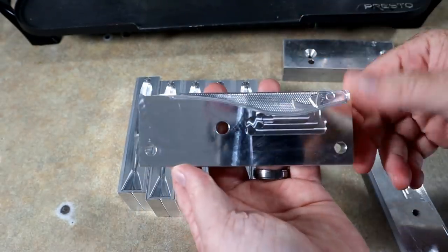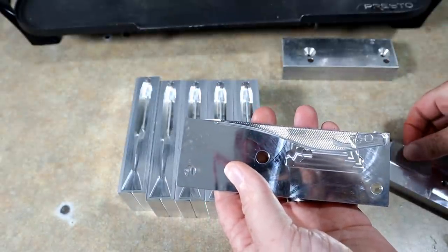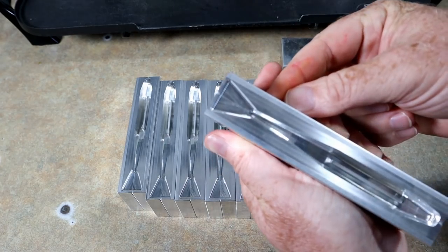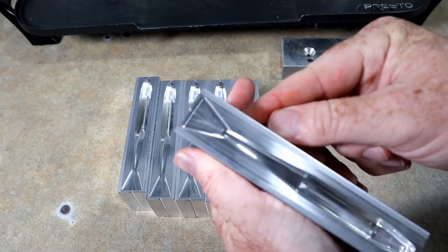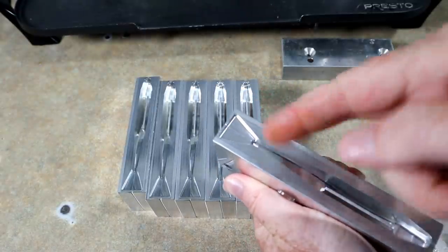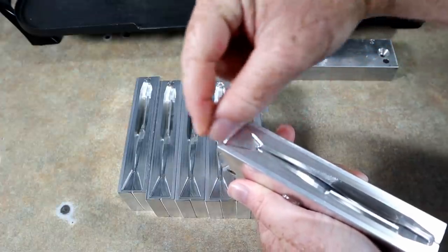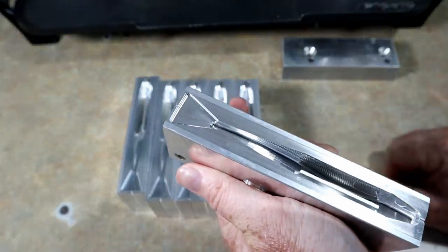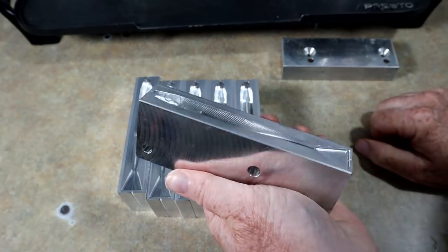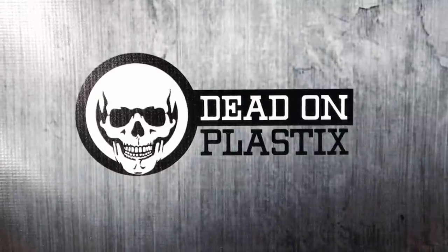This is actually a little bit bigger bait than the four-inch, definitely lengthwise. The way we did the tail was a fan tail — it's not a split tail, it's a webbed tail so to speak. That was basically for pourability. If you look at a traditional split tail jerk bait, those little tiny fringes — we knew that would be pretty difficult to pour and also pretty difficult to machine. One of the things we wanted to do was keep cost low. This mold is $39.